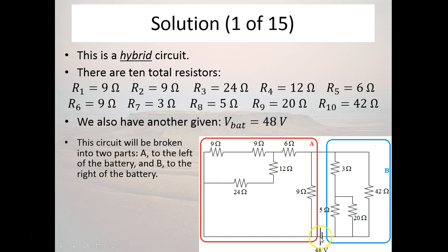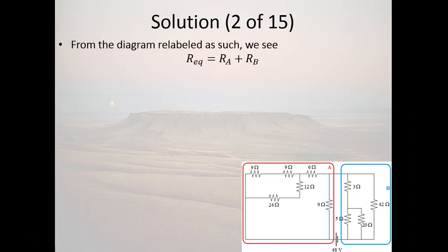Current comes out of the left part of the battery — the flow of positive charge. Even though we know electrons flow counterclockwise, the current we're saying is going to have a general clockwise flow. It comes out of the positive terminal, hits this junction, and either goes through resistor 9 or goes through the rest of this. Either way, the current has to go through the whole box we're calling A. After merging back together, it skips across this wire and enters the area we call B, then comes back to the negative terminal. So first the current goes through A, then through B — that's a series-type hybrid.